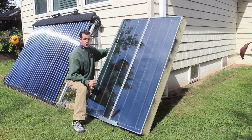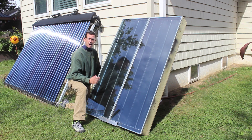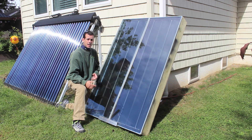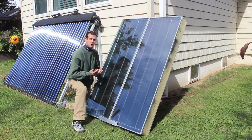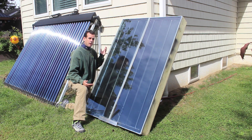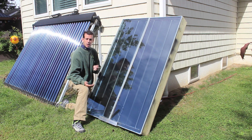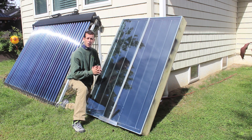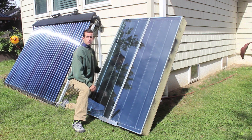Additionally, once you transfer it into the house, I see so many people's collectors that have no insulation on the piping going to the house, or they're sending it through a window that is not insulated well or is open. You may be losing more BTUs during nighttime hours through this uninsulated window than you're putting in during the day. The chain is only as strong as the weakest link, so you have to have the entire system insulated well — the collector, the piping to the house, through the structure, and so forth.